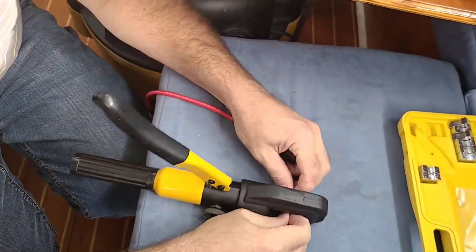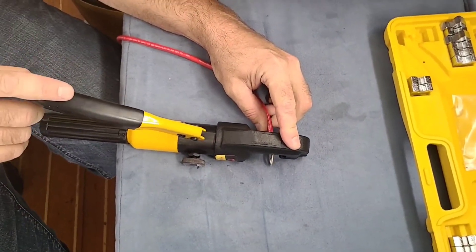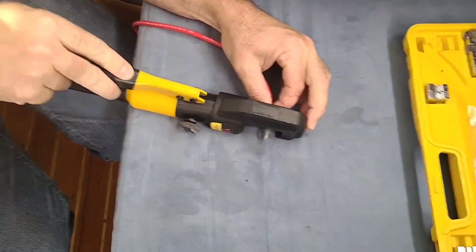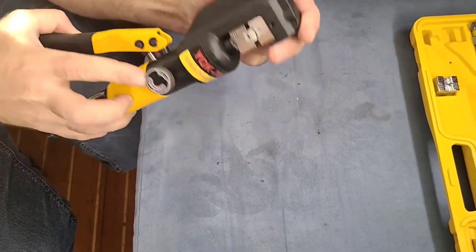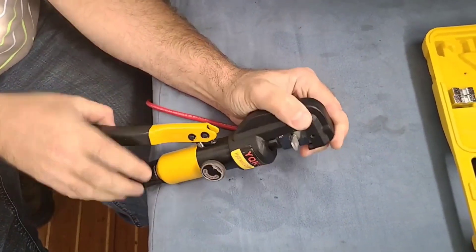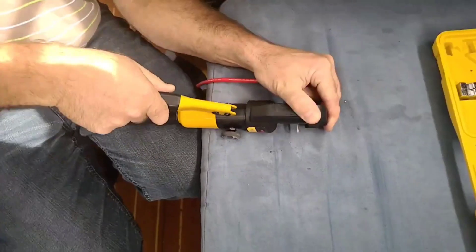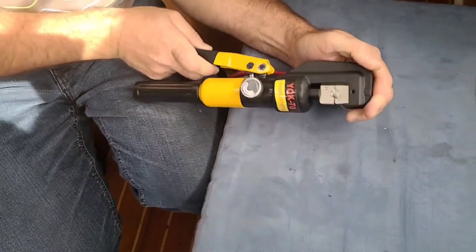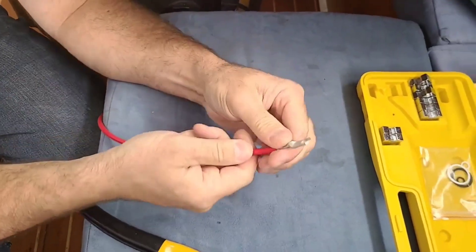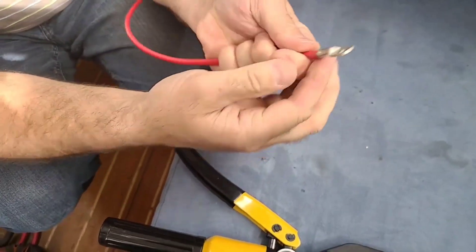The only downside with this press compressor is I just need extra hands. It started to bite — it's time. Push the wire all the way in and continue to pump it to make it tight. This is it, not going anymore. It's a funny compression but anyway it's the most reliable method, so I'll put the heat shrink on it and it's good to go.